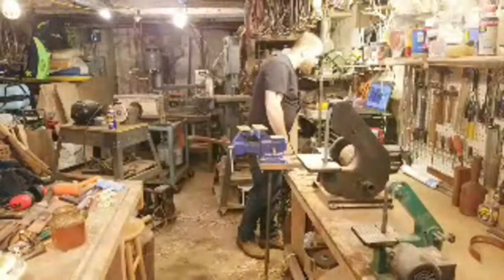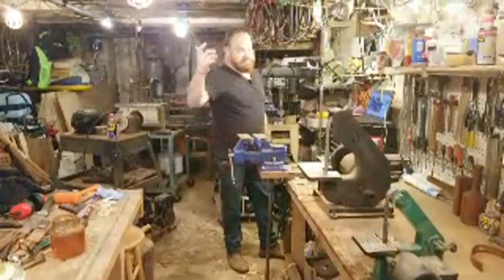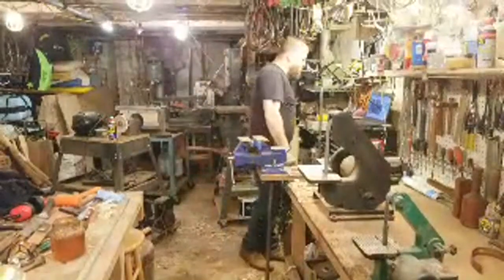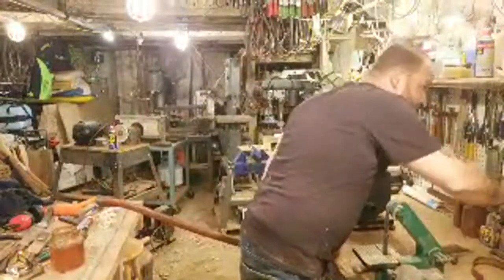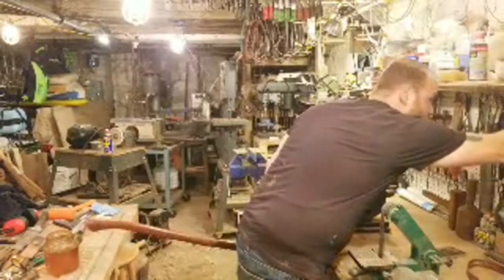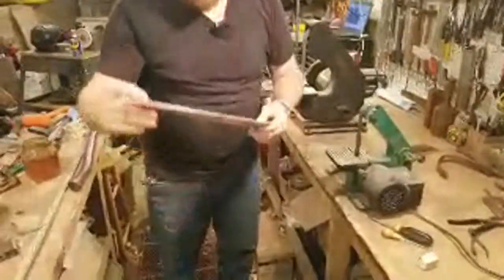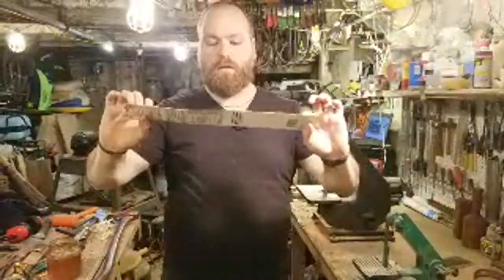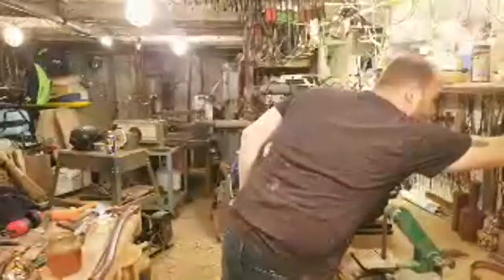Brand of file for axe sharpening. Nicholson. Nicholsons are not that expensive, and they're one of the best for a reason. So a Nicholson Mill Bastard file, something like this. This will be my last tip of the day. This is the one that I actually keep in the wrapper because I like to keep it nice and sharp, and I really only use it for sharpening knives and sharpening axes. You can see it's a nice Black Diamond single cut bastard file, 12 inch, works really well, nice and sharp, good for sharpening steel, sharpening axes. If you're going to sharpen by hand, definitely use a file.